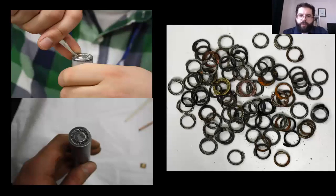The raised inscription on the rings would have been imparted by stamping it in a die, like hand-struck coins. Coins from this period are made in a two-die system. The bottom die, which was sunk into a bench, is called the anvil die and is traditionally engraved with the heads. A coin blank is placed on top of the anvil die and an upper die, called a hammer die, is placed on top and struck with a hammer. The prototype die was constructed and experimentation began.